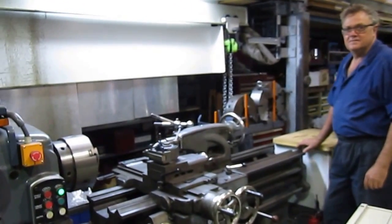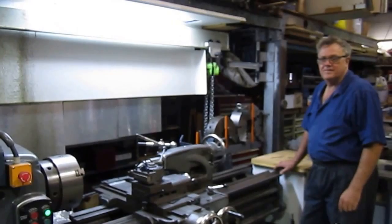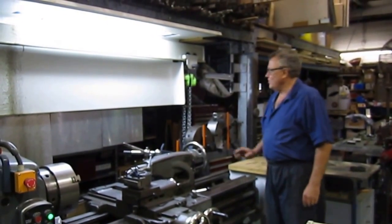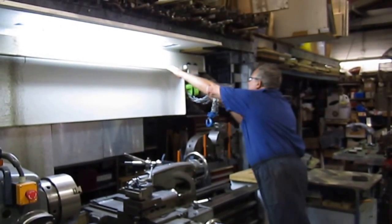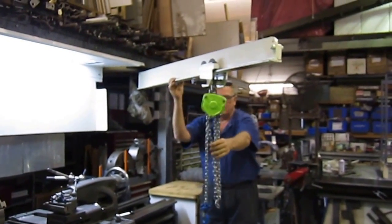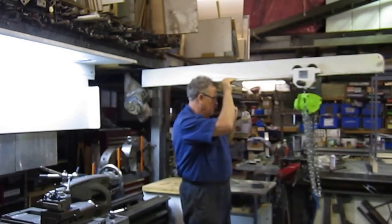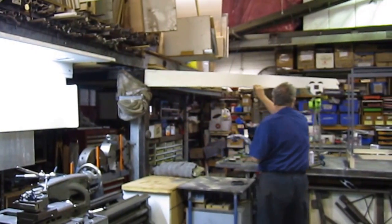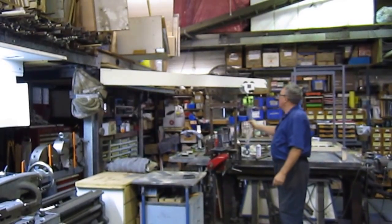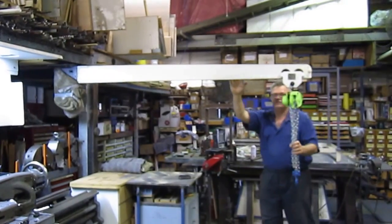He built himself a swing arm and he'll show us how he operates that swing arm. Thanks Bruce. I'm getting far too old for all the heavy lifting. So the swing arm simply comes out this way with a long chain block on it, which I've shortened the chains on so that it's easy to operate over a short distance. It's designed so it will actually run right around the corner onto the bench, so if I wanted to put a chuck onto the workbench I could do that directly from the swing arm. It's also very useful for small lifting jobs in the workshop.